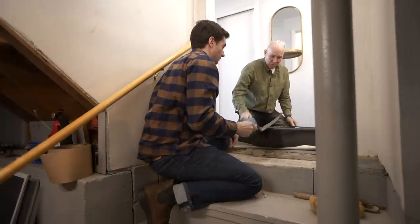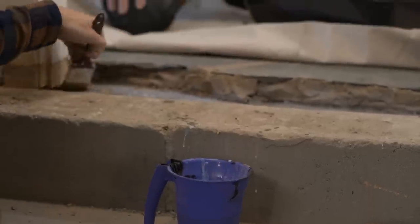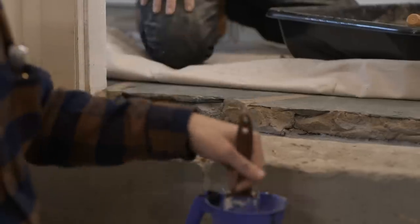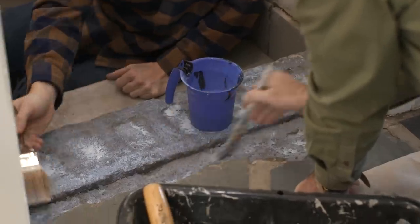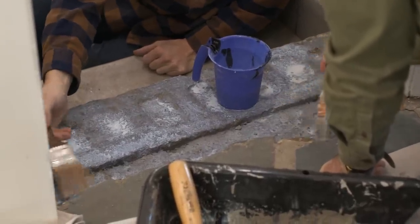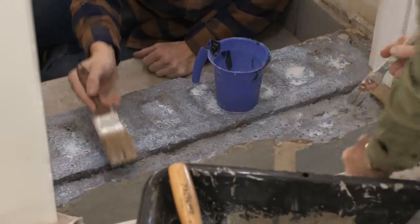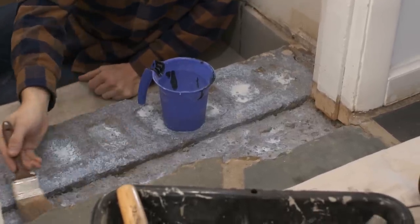This is looking pretty good, but before we lay down our mortar bed, we want to add a bonding agent. You can apply the bonding agent to the mortar directly, or what I like to do is get a paintbrush and paint it on — that way I get all the nooks and crannies. You can't use too much. We can use it whether it's dry or wet. What they didn't do the first time here was pre-wet the cement block. What that did was suck out all of the water out of the mix and made the mix very brittle — that was the start of the problems with those two flagstone.